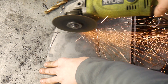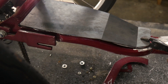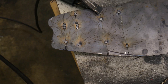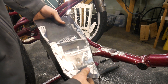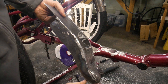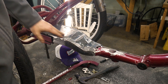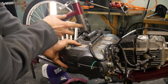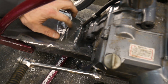Once it's to the desired shape I score it with the grinder so that I can bend it. Now it fits nicely to the frame, and finally I cut out some side pieces to finish up our little mount. So here we have our aluminum-to-steel conversion. I took one piece of steel, bent it up, then took another piece, cut it to size and bent it this way. Now it fits nice and snug over this area. I'll drill some holes and bolt it to the frame. Since it's steel, I can weld to it — I'll get a motor mount from here to here, and on the bottom I just need to make a motor mount that welds right to that.